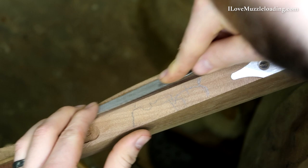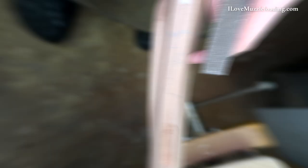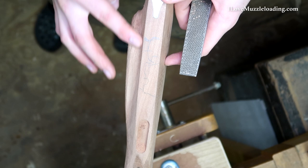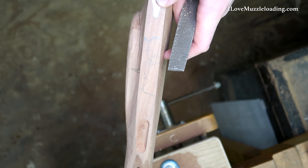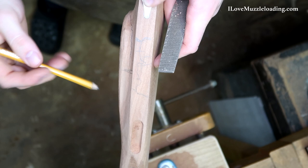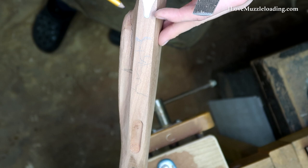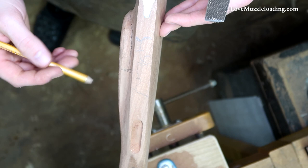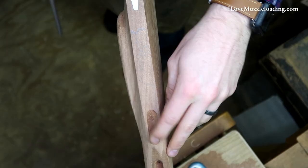I'm going to bring out just a little bit of a larger rasp. At this point, I've got up to about here feeling pretty good. I have a nice really balanced curve as we go around here. I don't have the hard line in here like I'm hoping to get as we work on this, but I'm getting there. And where I'm going with this is I want to get all of this in the same ballpark before I move on. I don't want to finish the area back here and then move up here and take it to completion. When I'm working on a section like this, I want to take it all to a completion point gradually at the same pace. I've worked back here some — I want to make sure I get this front area finished up before I do a whole lot more back here. I don't want to throw myself off as I'm working on this.